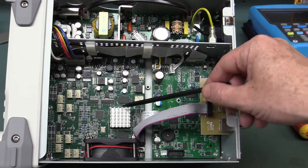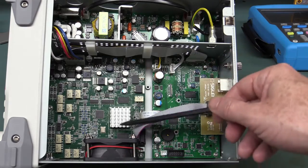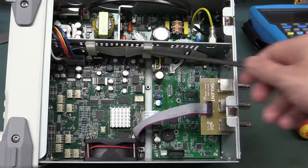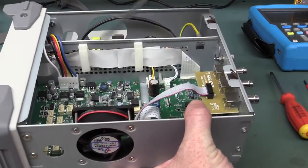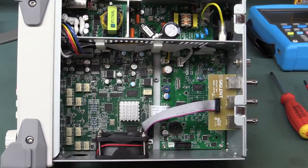I like that there's the main FPGA down there by the looks of it, and the fan is sucking air straight across that heatsink — beautiful. They're blocking the vents up here though with all the ribbon cables — that's a bit meh. But it doesn't matter because we're not talking about much power at all anyway.